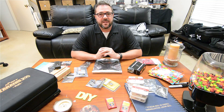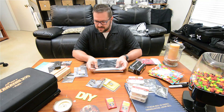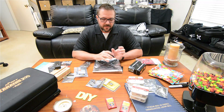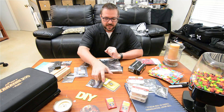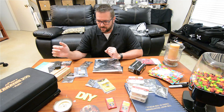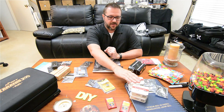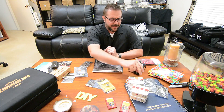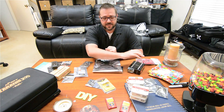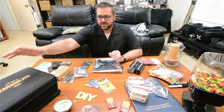So this is what we're dealing with — all the parts we need to build our racing drone. There are lots of options and it gets confusing because there are so many variations. If you go online and look at videos, they're all very specific from part to part. You may be using an XSR receiver or a different brand. Same for the antenna, same for the camera and video. Motors all play a role, what ESCs you get, batteries, how quickly they can provide charge — that determines how much thrust and how fast it will go. And then what controller you get and the pros and cons.